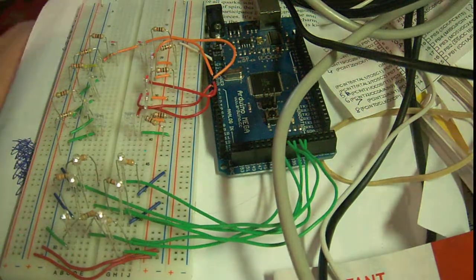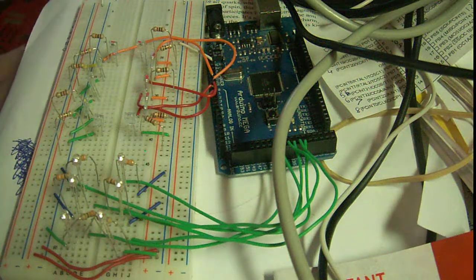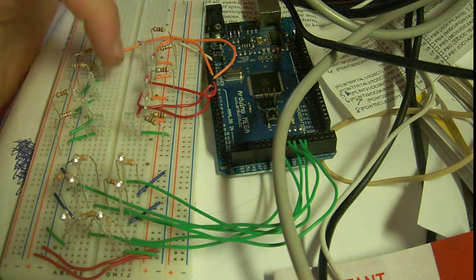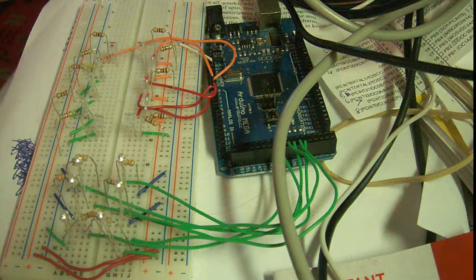For the debouncing, so that if you press here it doesn't read the button a million times, I have it delaying 305 milliseconds, so that if you just tap it, it doesn't read your button press. I quote the word button, considering there's no button here — you're just breaking an IR field, which humans can't see. But there would be a button here, theoretically speaking.